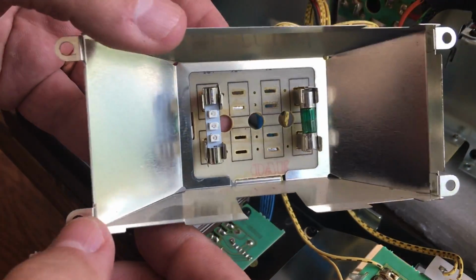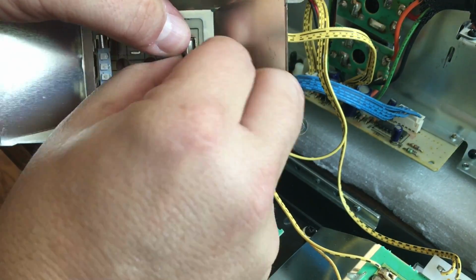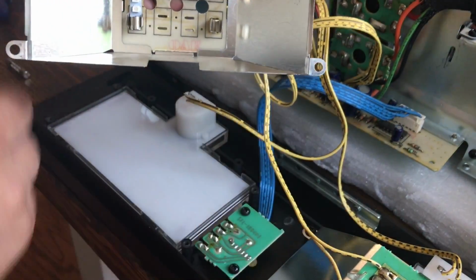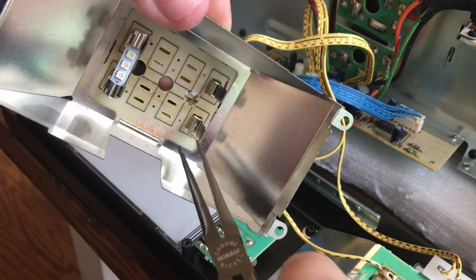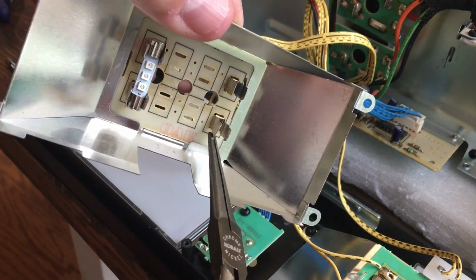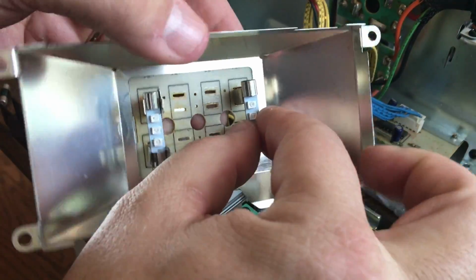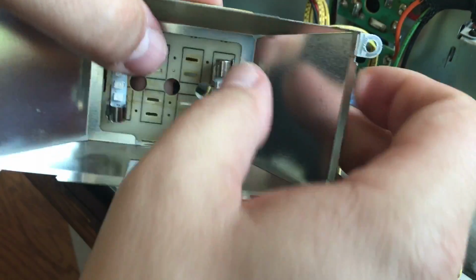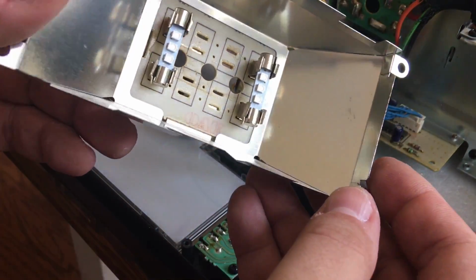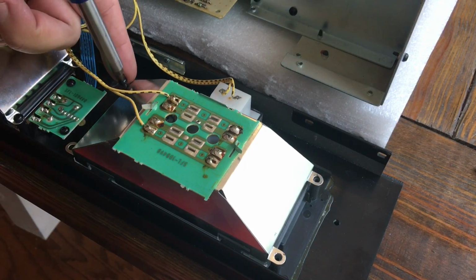Now, maybe I should have turned the LED a little bit to the side for reflection, but you'll see here in a minute that it doesn't seem to make that much difference. It still looks good. So do the same thing with the other. Bend the tabs, and we'll go ahead and fit in the other LED lamp. Just snaps right in place. And again, you can adjust it if you'd like to the side or not to reflect off of the side. I didn't do that. But I just need to do this with both units, left and right.